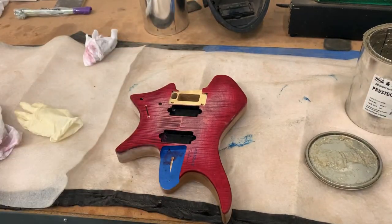When I go to do the top I want to be very careful that I'm not sanding so much that I'm taking off too much color — I really want the color to stick to the guitar. Since it's 100 grit, I don't need to use too much pressure. I can just kind of lay it on there and use the weight of my hand as the amount of pressure I need.